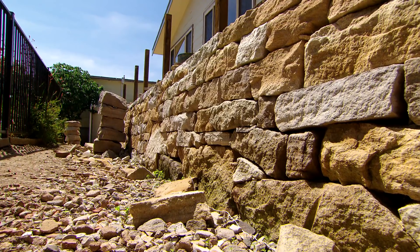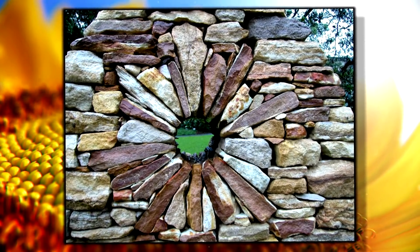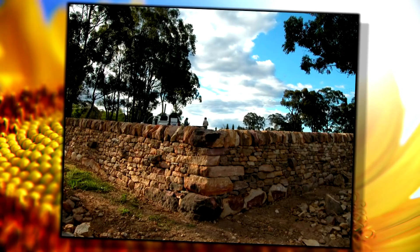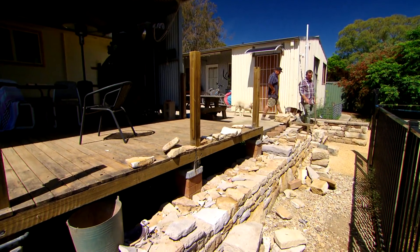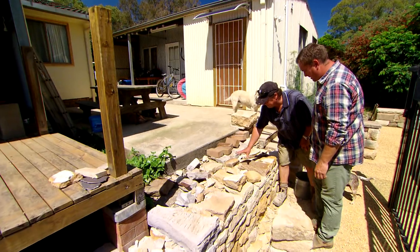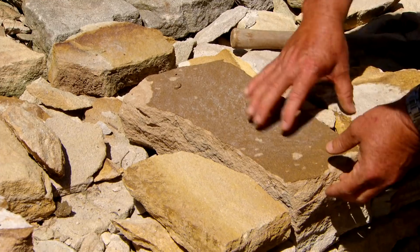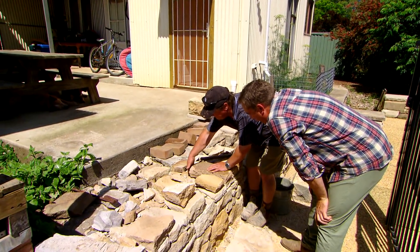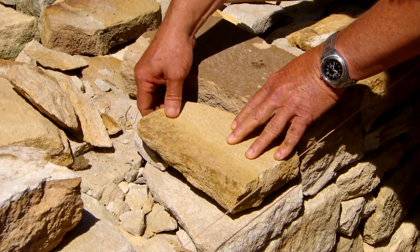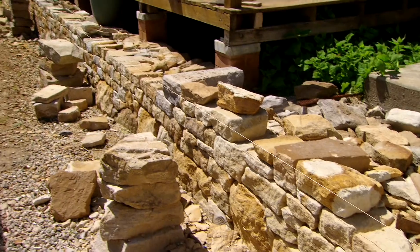So to someone who's never done it before, how does it work? What holds a drystone wall together is gravity and friction. If you look at a wall end on, it'd be like a capital letter A — two walls leaning against each other and filled in the middle, so the wall leans in on itself and all the stone naturally wants to go straight down, not in or out. There's no wasted stone, and all the stones' length goes back into the wall. We try and use wedge-shaped stones so we've got more stone-to-stone contact. It's all the stuff going on behind the wall that you don't see on the face that makes it strong.